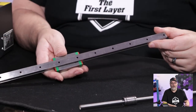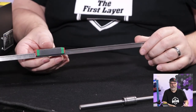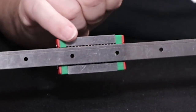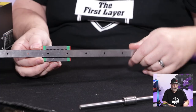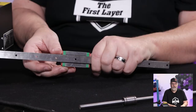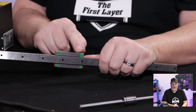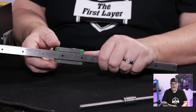Here we have a linear rail. What is a linear rail? It's a stiff piece of metal that has been machined, and it has what we call a bearing block. You can see inside there are little ball bearings. These ball bearings move back and forth very smoothly, traveling in a continuous loop around the inside of the block. You absolutely have to grease these, much like any other type of bearing.